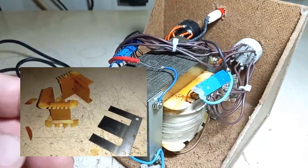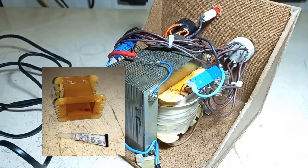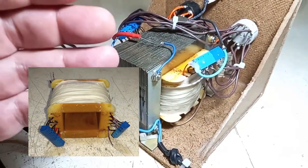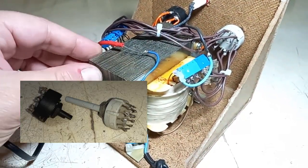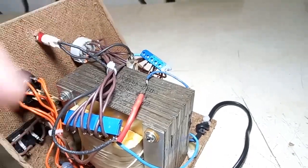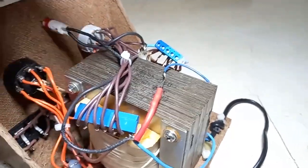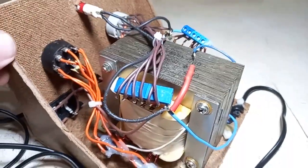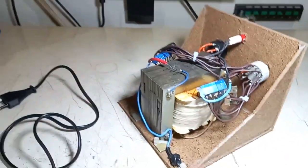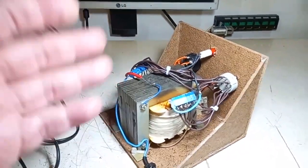The transformer comes from a computer UPS that was rated for like 600–800 volt-amps, so it was a kind of medium sized one. Originally it has the low voltage windings made with really thick aluminum wire — in fact one particular thing about this transformer is that it's made with aluminum wire. I reused the enameled wire of the primary winding to make the autotransformer, and considering that aluminum can't be soldered, I used screw-on posts to make the taps. I made roughly the same amount of turns as the primary to make the autotransformer. As a note, you may know that in my channel aluminum wire and fake components are a must.